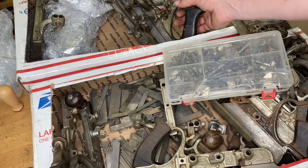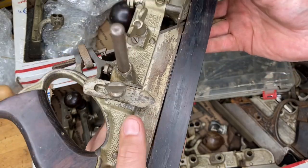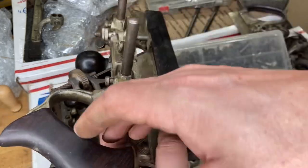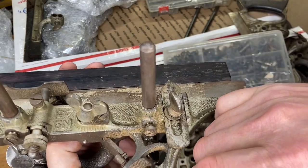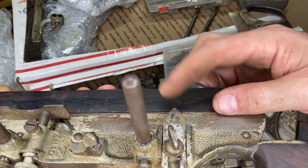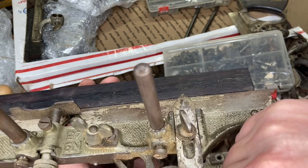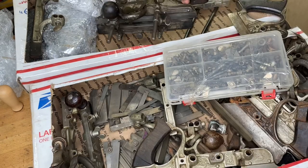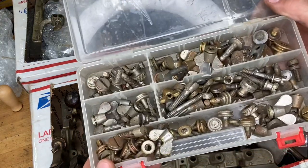A common question is what the slitter is for. You want it to be really sharp — the idea is you sharpen it and then cut thin veneer with it. Using the fence set against your stock, you can actually cut thin veneer with a nice sharp slitter without getting your saw out. In hand tool work, with the fence in place you could probably cut a straighter line with a sharp slitter than with a handsaw, unless you're really proficient with a handsaw.